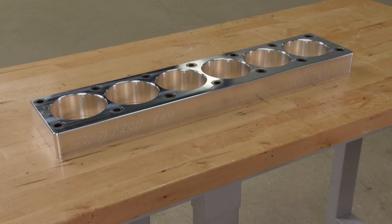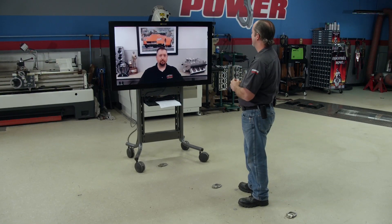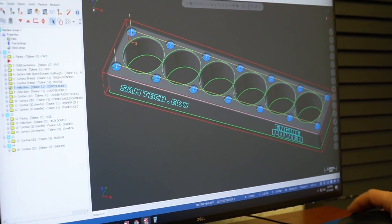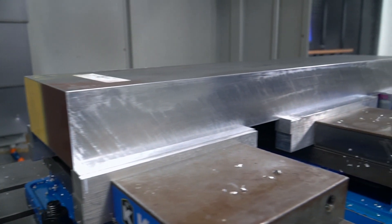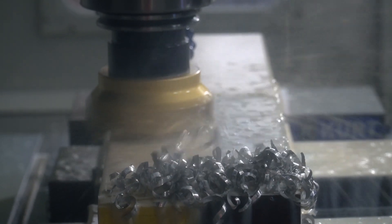I'm extremely excited because we had you do a special project for us — tell me about that. We were able to get a blueprint for a gasket for this Ford 300 motor, and from that gasket blueprint we were able to create a CAD model of the torque plate. We're making this torque plate that's 28 inches long by about six and a half inches wide, two and a half inches thick — and it's an inline six, so it's a massive piece of material to put into our machine. We have our students go in, get that machine set up, get all the devices and tools set up, and then spend all the time actually cutting it. The run time for that torque plate was approximately eight hours.